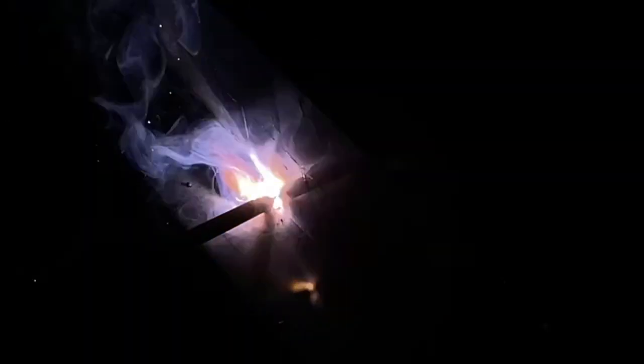To get this process started, the first thing we're doing is holding that torch at a slight angle — about a 75 degree drag angle — and we're constantly being conscious to keep that material straight into the center of the joint, to keep a nice 45 degree height on that rod all the way through. This allows us to focus our heat right into the corner of that joint.